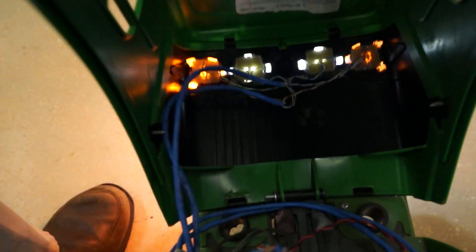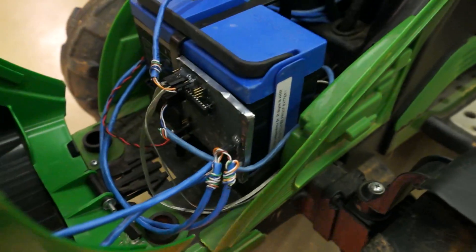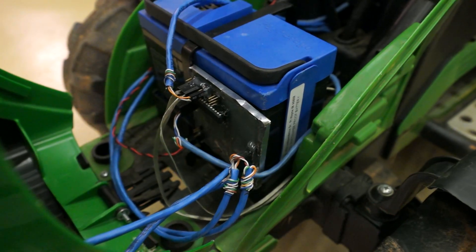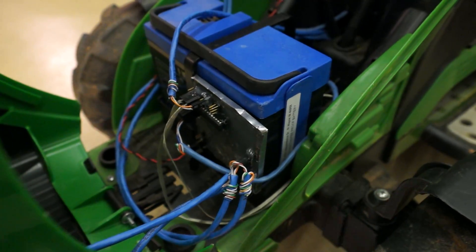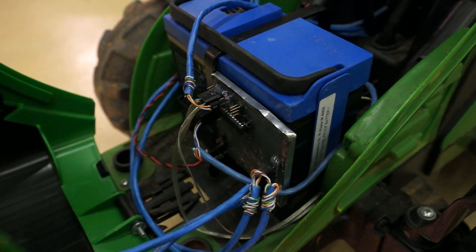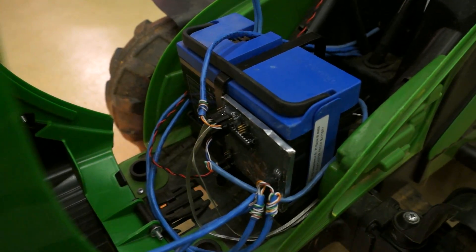Under the hood we have the circuit boards that I mounted the LEDs on. They've got some Ethernet wiring, which I just used because I had a lot of it laying around. Those wires run to the microcontroller, which I mounted onto the front of the lead-acid battery. I created a little tray out of aluminum flashing and submerged the entire microcontroller board in about a quarter-inch thick layer of hot glue to protect the board from the environment. The bottom side of the board has a lot of components — transistors and little things like that — that I wanted to protect. The microcontroller chip itself is in a socket so it can be removed if necessary. All connections to the LEDs, sensors, and switches are through pin headers with appropriate connectors, with a little hot glue to hold those in place so they don't vibrate loose. The connection to the battery is through a twisted red and black wire pigtailed right into the main battery connector that goes to the electric motors.